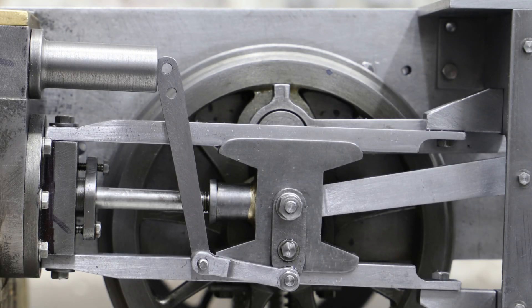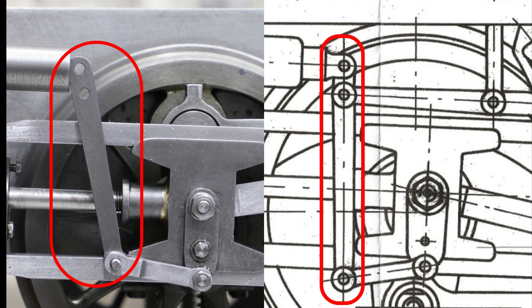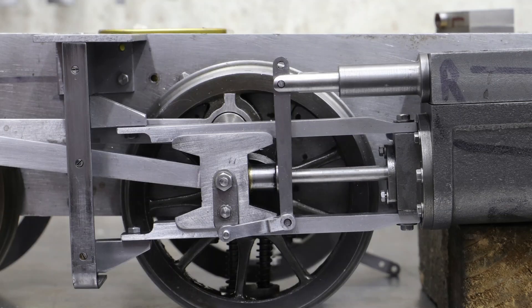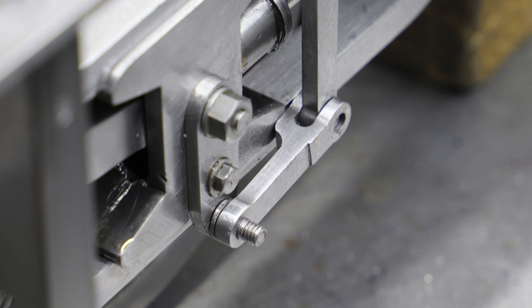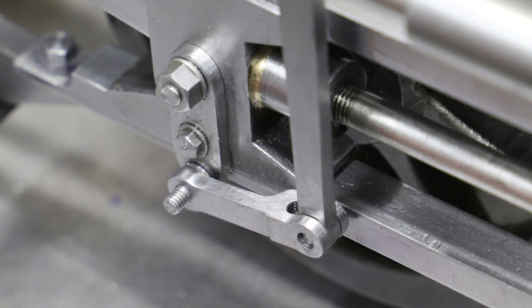After making the combination levers a couple of days back I thought they were looking a bit short, and when I checked against Don's design I realized I'd made a mistake when I converted it into my CAD package. So I made a new pair. Here we can see one fitted along with the valve spindle and its associated guide. I've also encountered another issue where the union link fouls with the crosshead — the fix will be easy for the union link, but I'm going to really struggle with the pinning arrangement. One for me to think about.